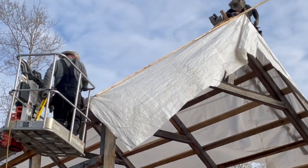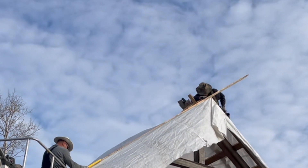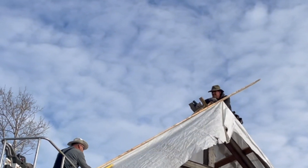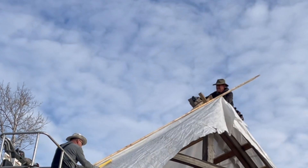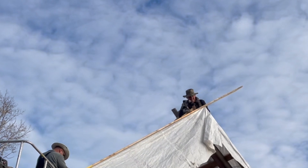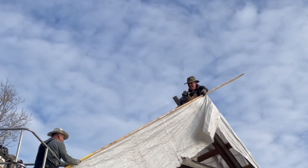You can see we're taking our time fastening this first board. The first board is of course the most critical — it sets your angle and your square for the whole roof to follow. So we're going to take our time, check the level and everything else, and plumb it with the fascia board. Once we've got all that set, we're going to put her in place and get her going.